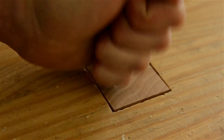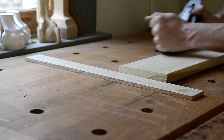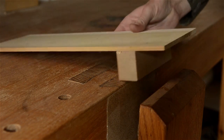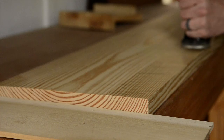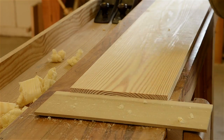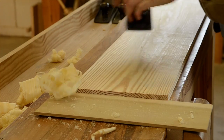I find it easier and cheaper to just make a planing stop out of wood. You can either make a stop that fits into your bench dog holes like this one with dowels — some companies sell metal versions of this style — or my personal preference, which we use in my school, is to make a planing stop out of a quarter-inch thick board glued to a scrap block of wood. I like a thin board so I can hand plane smaller boards. This quarter-inch poplar board can be purchased pre-milled at your local hardware store if you don't have an easy way to make thin stock.